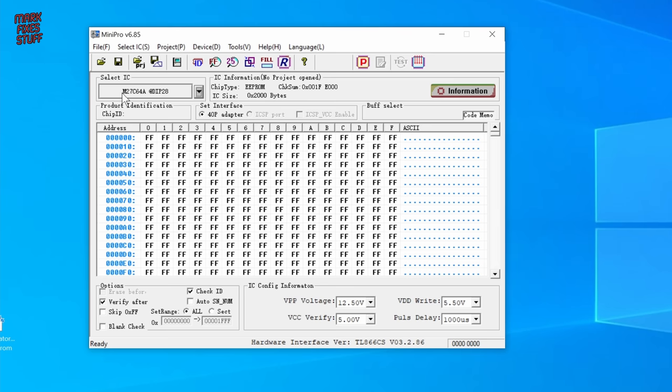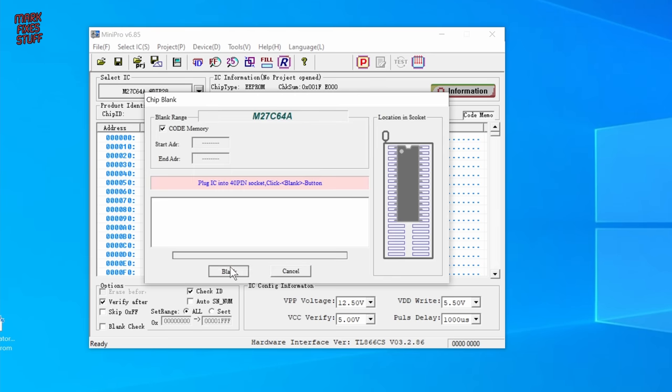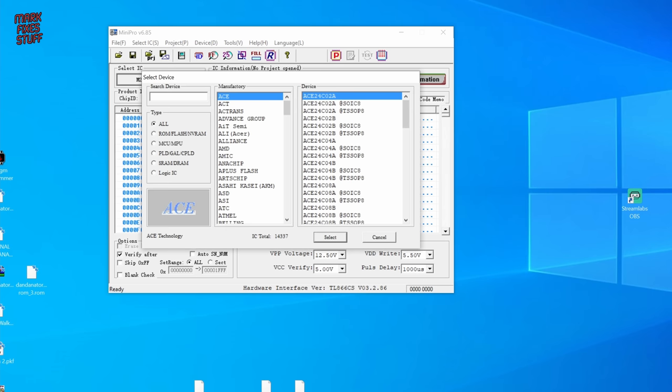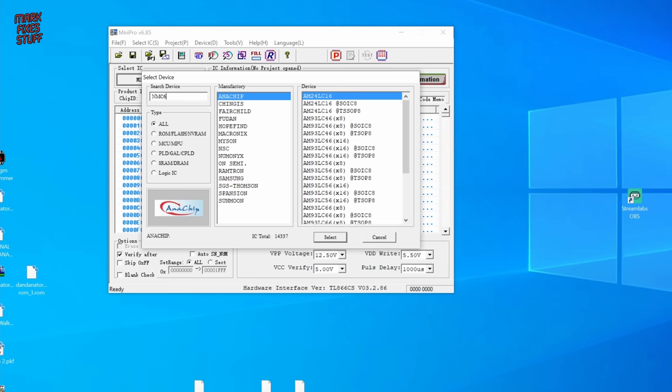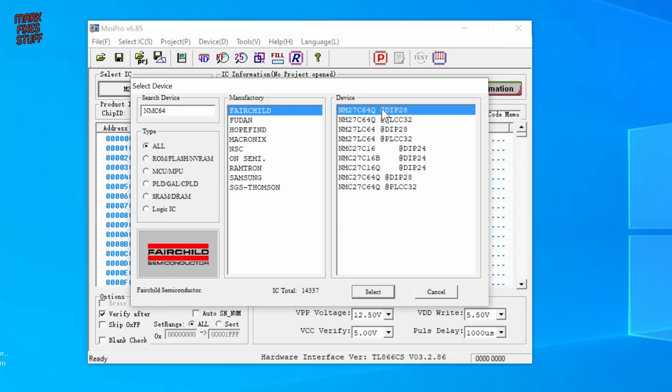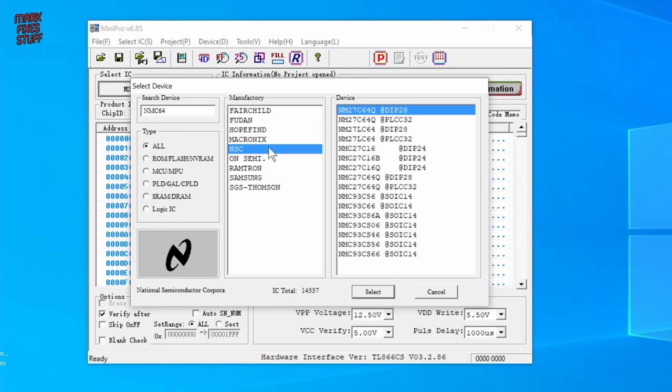So this is the part number that's marked on the chip. It's wrong, and using it will cause the program to throw up an error. By googling the return part code of 8FC2, we found out that these are a skimmed and remarked National Semiconductor part, but are the right capacity and byte organization. By the way, NSC and Fairchild merged years ago, so share many of the same part codes, and either selection will work.